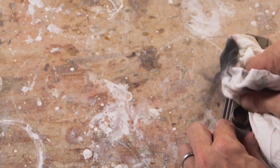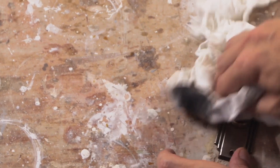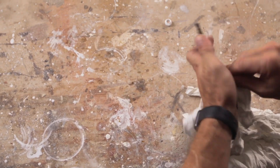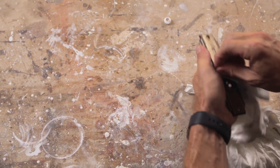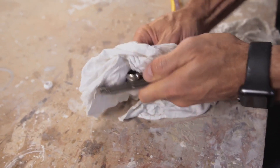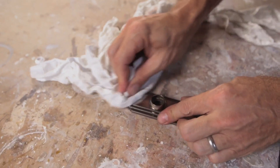One of the biggest challenges with polishing these is sometimes people use wire wheels or different things like that and it can scratch the surface. But Simichrome, for those pieces of hardware that you need a really nice baby-smooth surface and a nice shine, works really well. It's kind of like Brasso but brings out an even brighter shine and it also protects the surface when it's done.